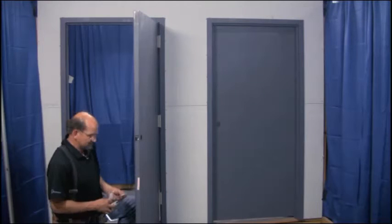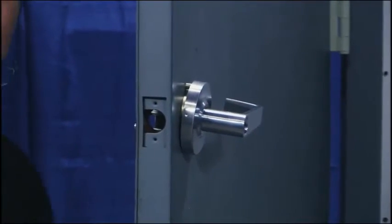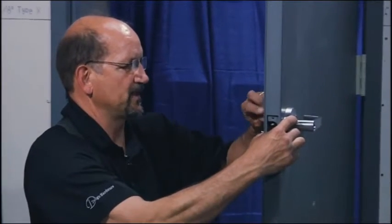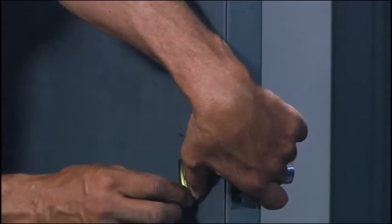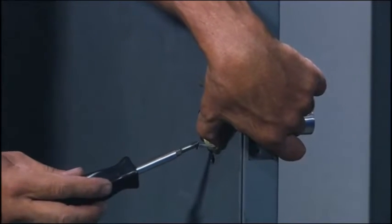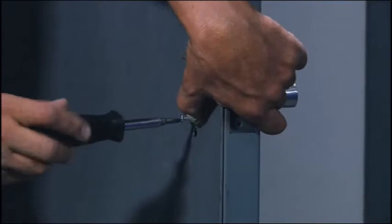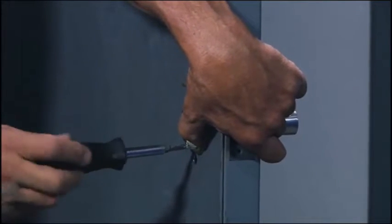Take the trim — you do have to have post holes drilled in it. A lot of your panics and doors already come pre-drilled with post holes. Put the key-in lever trim in and it will screw in place. As you slide the trim in, take the screws. It comes with a backing plate — you want the rounded edge towards the door. Put that on and just reinsert the two screws and tighten them up. I like to do this with a hand screwdriver. Nothing to it — it may take a little longer, but if you cross-thread and run it in with a power screwdriver, it'll strip them out or snap the screw heads right off. When you're doing smaller screws, it's just a good habit to use a hand screwdriver.